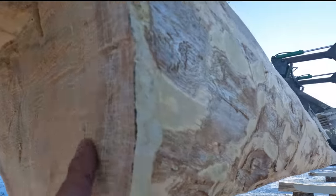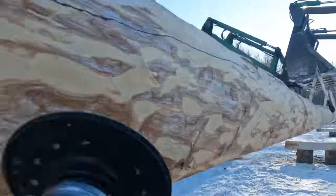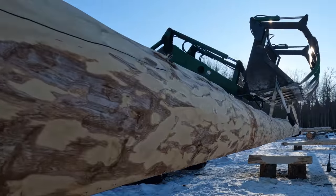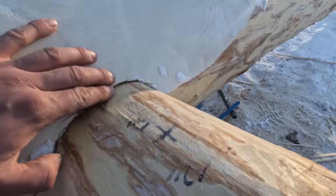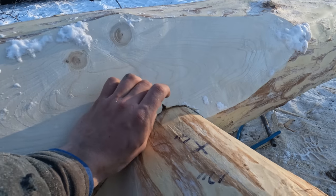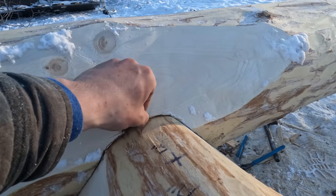And it leaves some bruising where the wood is hung up here. So I'll just take my little grinder and knock some of that off and get it to sit exactly where I want it. Maybe just a 16th of an inch above my line. That'll slide no problem. Don't ever mind the top of my notch. Like, we make it weak so that when it comes down, it'll break. It doesn't matter. Like, it's designed to crush.